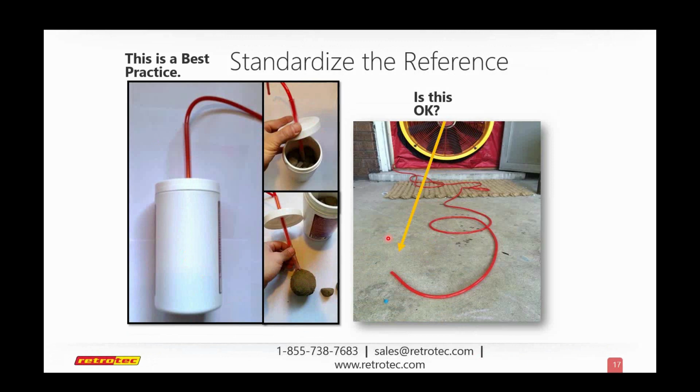That's great. He was saying that his software told him to change ranges in mid-test, which brings up a really important point. Whenever you're doing a multi-point test, let's say you decide you're going to test from 25 to 75, go to the range you think you're going to be on, go to 25, go to 75, and make sure you can get a reading. If you can't, you already know in advance that your software is going to tell you to change ranges.